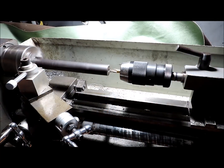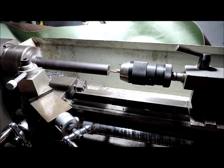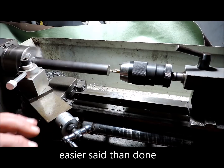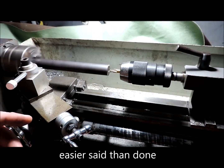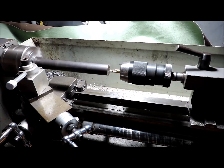I'm just making an arbor for the horizontal cutter that I have. It has a 7/8 hole, so I'm just getting this arbor ready to drive the cutter. There are a few steps to be put in it — a little bit of thread to go on. Just doing a centre in the end of it at the moment.